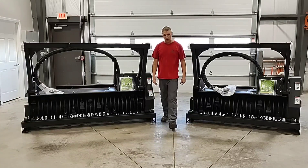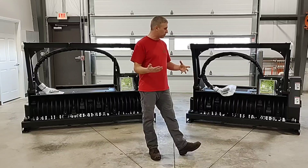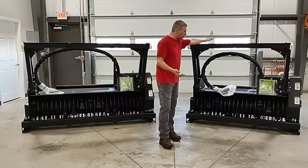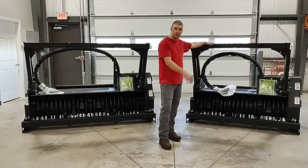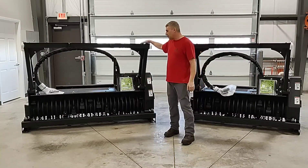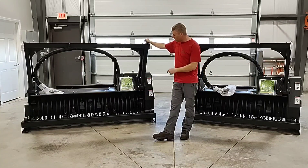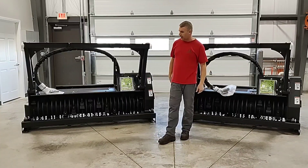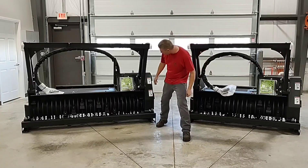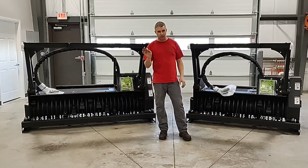My company has owned and run both of these. When I get out to jobs where I'm actually in the woods and can't bump into trees — I have to preserve trees — I like to stick with the 150D because I'm able to sneak between those trees and get into tighter areas, meaning less hand cutting. If I'm running in a wide open area with brush, I like the 180D because I have a little more cutting width and more inertia to power my way through stuff, and at the end of an eight- or ten-hour day it just gets that much more done.